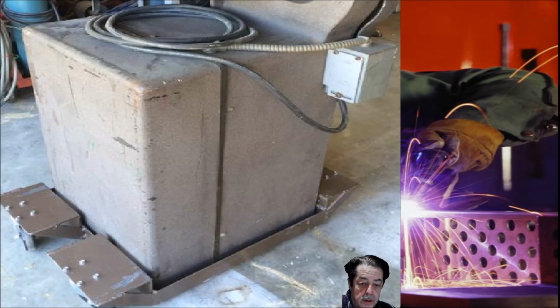I would use good thick angle iron. I mean, 1/8 inch thick, whatever. Like I always say, I go out to the steel supplier, I ask them where their scrap pile is, they show it to me, and I go out and root through it. But for something like this, around 1/8 inch or so is what I would look for. The gussets, same thing. I would build this thing very stout because you're talking about a very heavy piece of machinery that's going to sit on it.